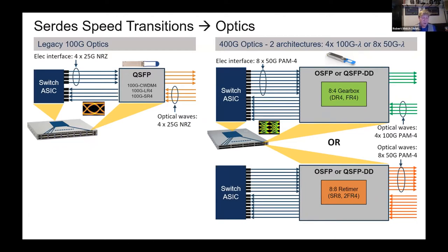The challenge with 400-gig is if you want a switch that goes to 25-gig or 10-gig — because with a 50-gig SerDes it's a 50-gig lane, built for a certain lane speed — you have to use clocking techniques to downrate it. That's what we call a gearbox. So this is eight lanes of 50-gig PAM4 to get to 400-gig.